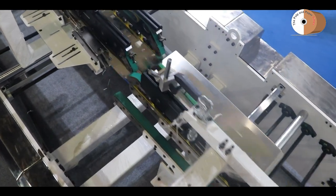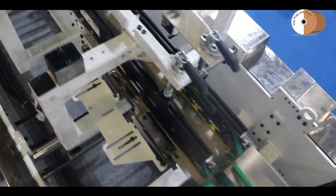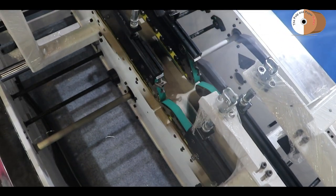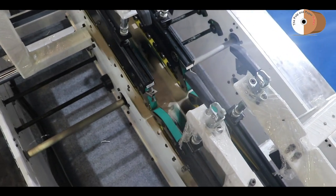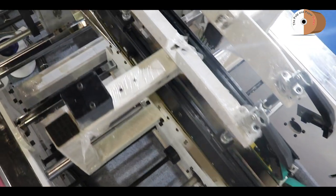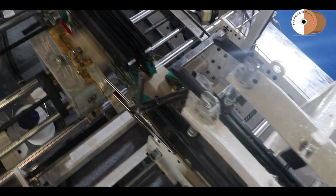From small carton to bigger carton and bigger carton to small carton, where we have more time waste on the third fold conveyor. We have made it pneumatic — each and every make-ready saving 20–25 minutes.